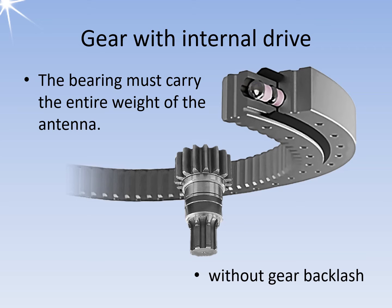The rotor of the bearing must carry the entire weight of the rotating part of the antenna array. This weight, often several hundred kilograms, falls on a few square millimeters of the ball surfaces in the ball bearing. If the balls of the bearing are deformed due to a lack of lubrication — that would be a lack of maintenance — the antenna would begin to vibrate as it rotates.